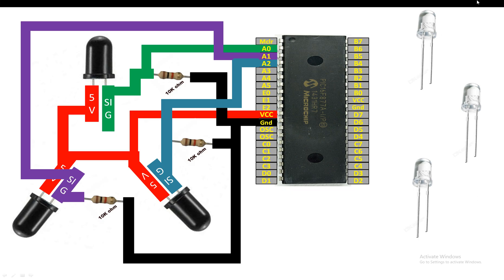For the output I will use three LEDs: the top LED for the top fire detection sensor, the center LED for the left fire detection sensor, and the bottom LED for the right fire detection sensor. Whenever fire is detected by a sensor, its corresponding LED will turn on. Later on you can modify the code — you can add an alarm instead of an LED, or use a water pump that starts sprinkling water as soon as fire is detected. You can replace these LEDs with any type of hardware you want to interface.